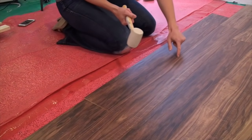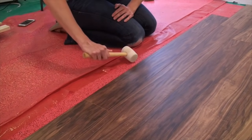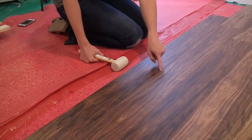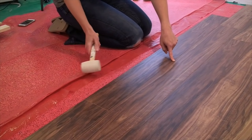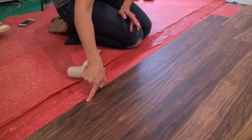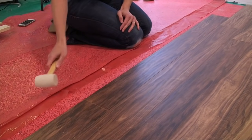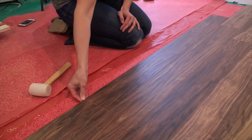You're going to see there's going to be a little bit of a gap. Take your rubber mallet again and tap it in at a few spots, and what you'll see is that opening between the two boards is going to go away. As you snap that tongue into the groove, the board is going to lay flat. You may have it sticking up just a little bit at the joint — you can tap it flat with your mallet, or when you get to your next row it's going to hold that joint flat and in place. Have it pretty flat, but it doesn't have to be exact.